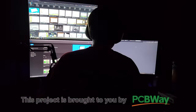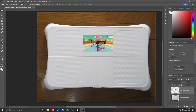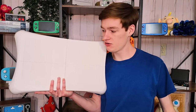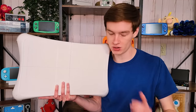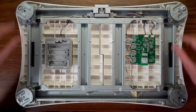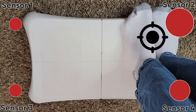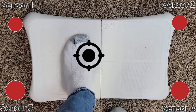To start, I spent countless hours in Photoshop fleshing out a potential design for this build, and I eventually settled on this rather inspired layout. Unfortunately, I don't know if putting a screen there is even possible, so I need to figure out how a Wii Fit board works to verify that cutting a hole in it won't destroy any sensors. A Wii Fit board is pretty easy to take apart, and it looks like there are just four weight sensors built into the four feet of the board, which makes sense. When you play games that involve leaning, the board just takes measurements from each of the four sensors and does a bit of simple math to figure out where your weight is actually distributed. The important thing is that there aren't any sensors in the middle of the board, so I should just be good to plop my screen down there, at least from an electronics standpoint.